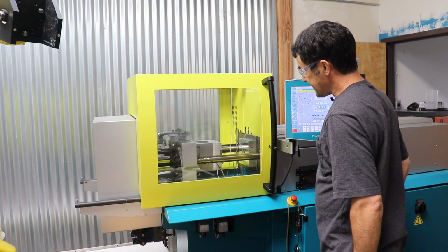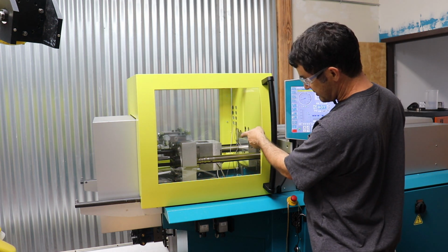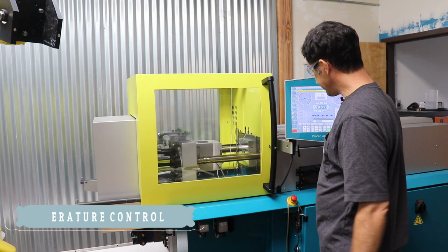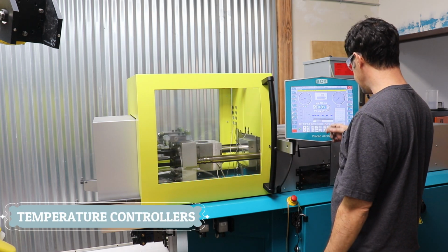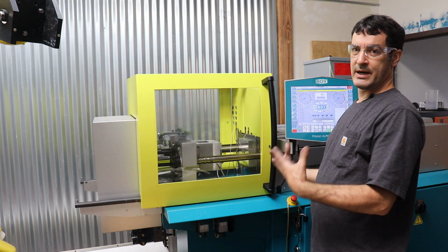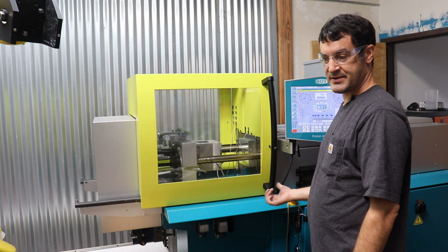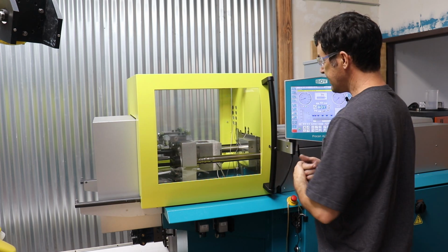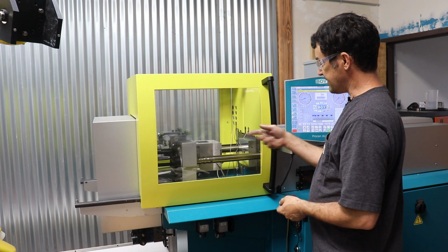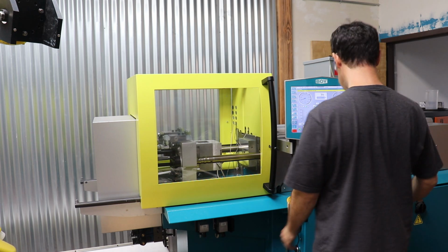So what we need to do now is get the heaters started. I need to tap the hole that we drilled, screw the sensor in, and then start the temperature sensors. I've already started to heat the plastic in the barrel, and the machine right now is heating its oil up. That's why the motor is running. It's actually squirting its oil through a little orifice inside of its hydraulic system to heat the oil. So we're getting close, and I will tap this hole and be right back so we can start heating the mold up to about 100 degrees C.